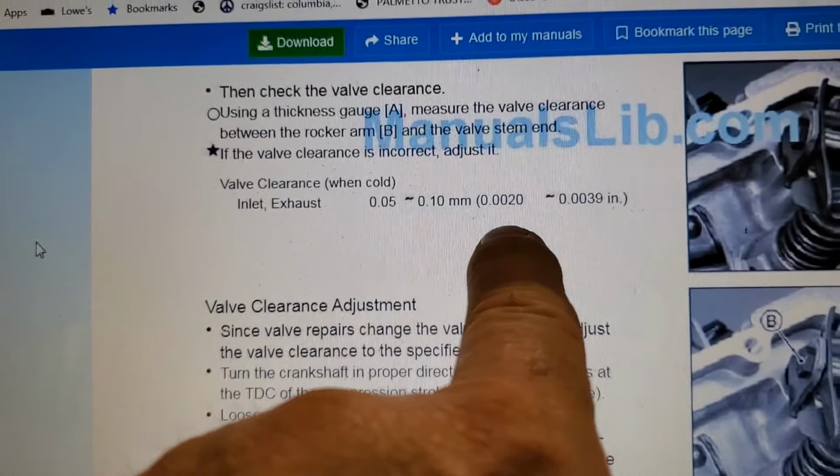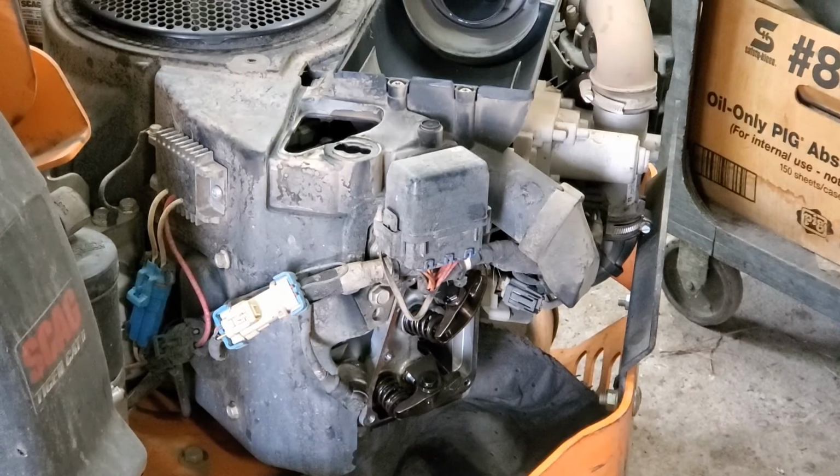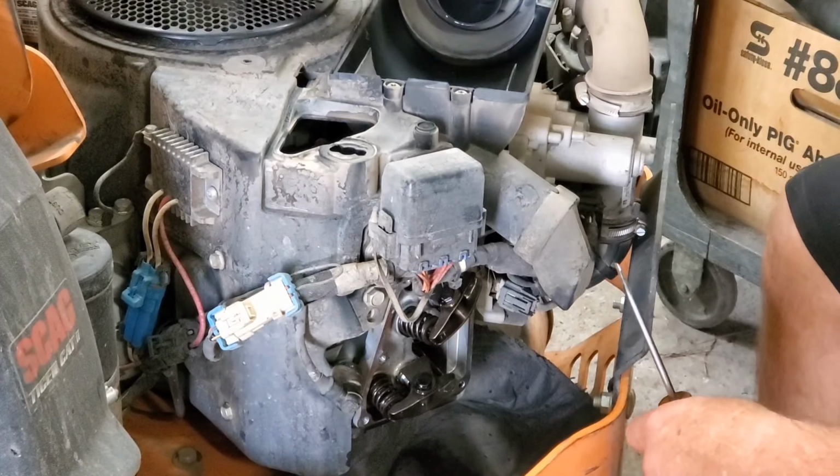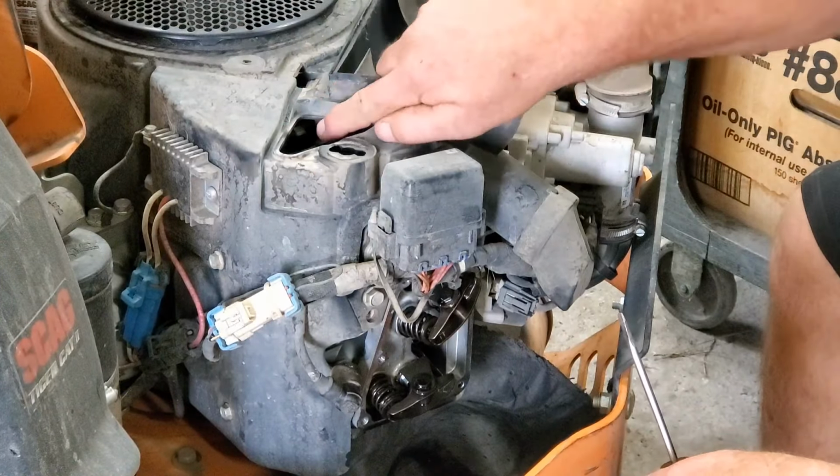All right, let's show you how to find top dead center. I've got the spark plugs removed just so it's easy to turn by hand. You can remove this cover. There is a procedure on some of these that are not fuel injected. They got a code on the flywheel, and that manual will show you exactly where to set the crank, and they're lettered like A or B and cylinder 1, cylinder 2. Inside the valve cover, it'll tell you cylinder 1 and cylinder 2. Okay, simple. So the fuel injected ones are not marked the same. They do not have the same coil.